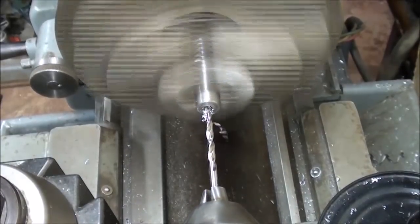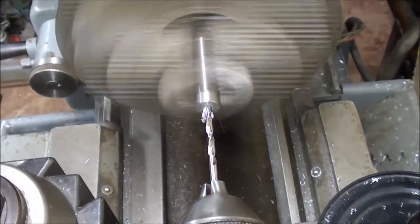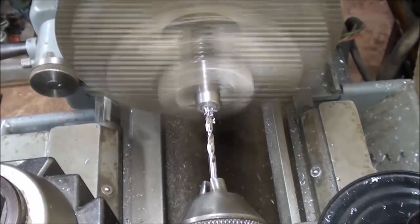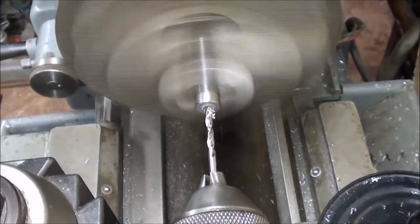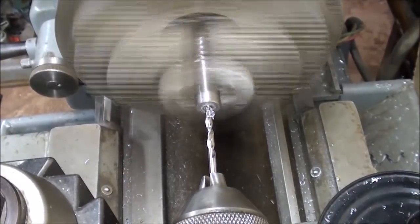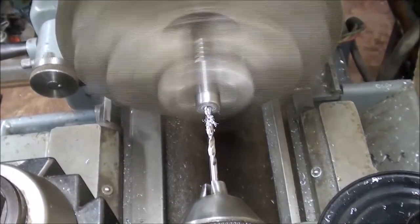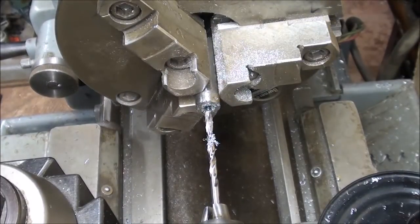You don't want to break a drill bit off, or a tool off, when you get this close to the end, because it would really be a heartbreaker. So take your time. This eliminates all the need to harden this piece as far as I'm concerned, which would be one more step and the possibility of it cracking. Alright, I'll take it out, degrease it, chamfer that hole, countersink that hole ever so slightly, and the piece is ready to be held in with Loctite.